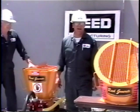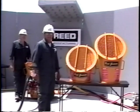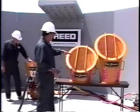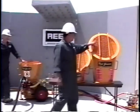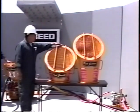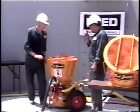Reed also offers a wide range of hopper selections. The short and tall premix hoppers are great for people shoveling into the machine — you take a scoop of material, throw it into the machine, it hits the back, the material falls through, and any large aggregate falls off. That's very important so the large material falls off rather than bridging on top. These are also important for size requirements where a low-profile top is needed, such as when mounted on a mixer.